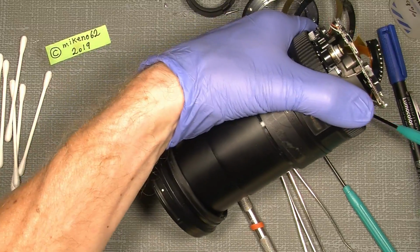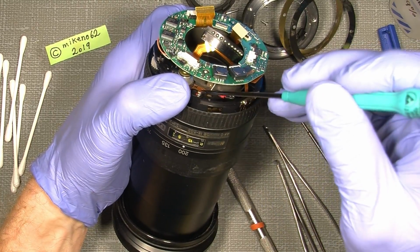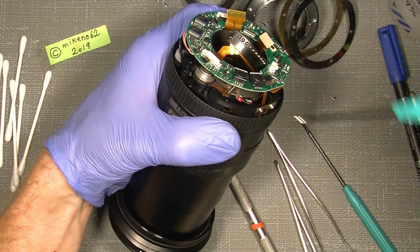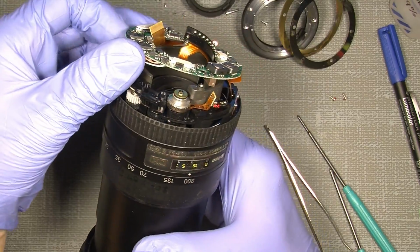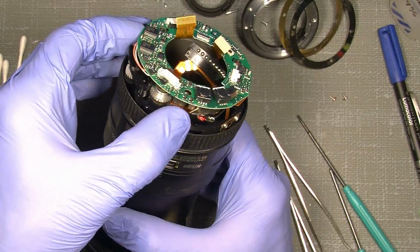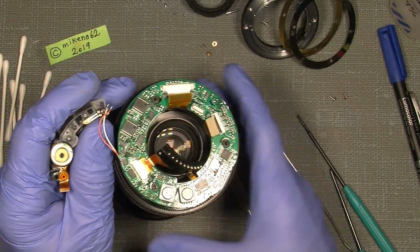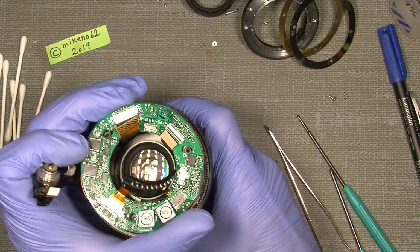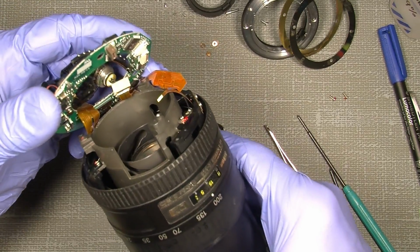So out of those, and the other one, take care of the flex. And now it's loose. So then I can simply lift off the main board here and the USM assembly. So that's quite easy, but take care of the 2 wires here. They're pretty thin. Just have a good grip on those, and then I can, let's see how it will go, dig under it so we can see what's happening here.